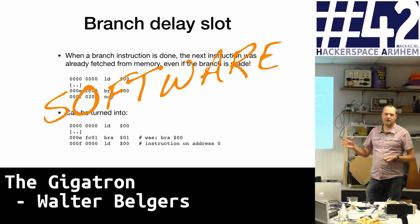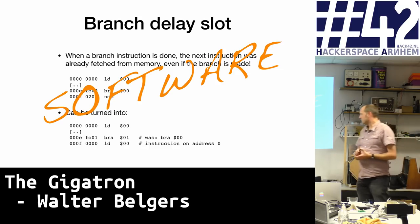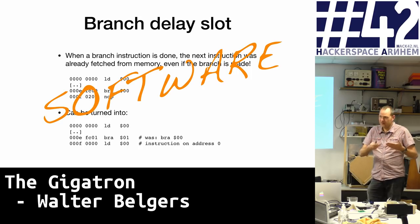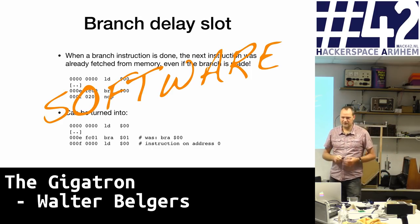With some clever coding I can make sure no clock tick goes to waste. This is interesting because if you have a SPARC processor, you also have pipelining and need to take care of this. In ARM architecture, those pipeline-fetched instructions are deleted on a branch. If it's a conditional branch, in our system it will always be executed — either way you end up at the next instruction or the branch target. That's why I say keep the hardware simple, and we can use this in software.